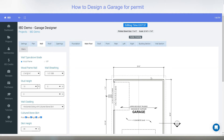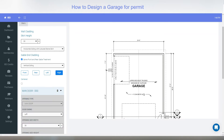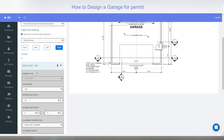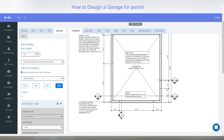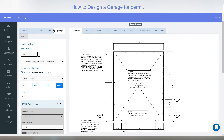Going back to walls, it's automatically gone to 2x6 — above 9 foot 10 it automatically switches to 2x6 because it already knows 2x4s are only good up to that height. Back in openings, maybe on the right-hand side I'll put in a man door. Instead of centering it, I'll move it 6 feet from the left corner. Now in the foundation plan you can see the 6-foot dimension, the rough opening of 3 foot 4, and all the notes are on there.